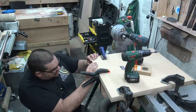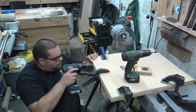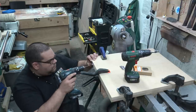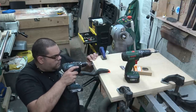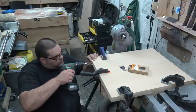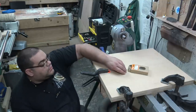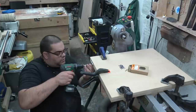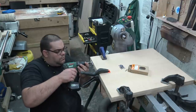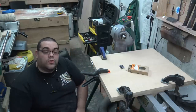I'm going to line it up as best I can across the centre, drill a pilot hole, and take a couple of screws — gently, making sure I don't wreck the MDF. Let's do the other one as well. That one's in place, now I'm going to put the other one on, and once I know they're in the correct locations I'll put all six screws in each hinge. With all the clamps removed I've got a nice hinged piece, so let's put the bolt back in.